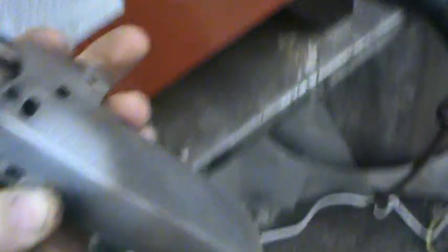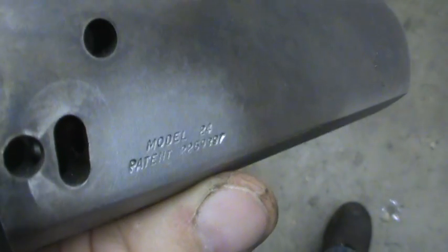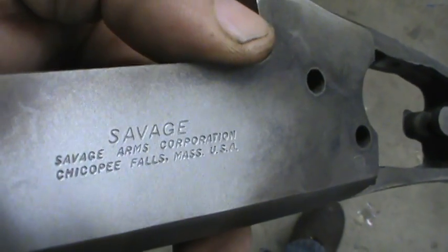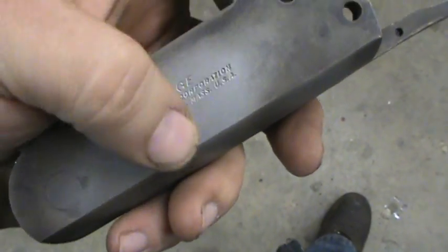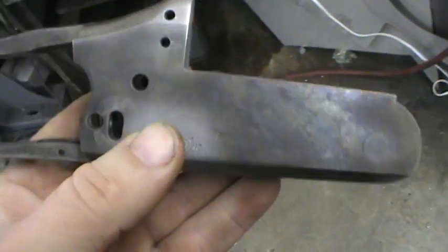Let me cut that noisy thing off. I'll pull this up out of the cabinet and shake the crud off of it. You can see how it does the metal — hopefully I can get this focused right around the hole we're going to weld up. It takes it right back to a nice all-over sheen, smooth to the touch, very very little etching going on. That's about what you do with glass beading.